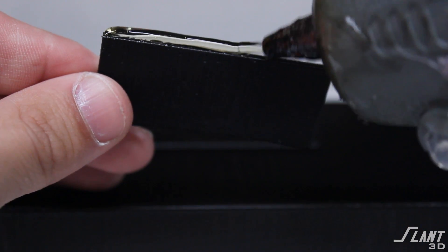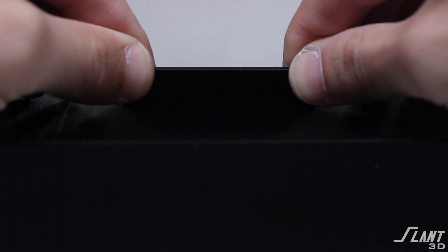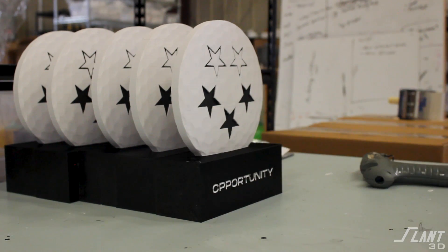There are a lot of parts out there that have to be glued together, and when gluing any type of part you have to deal with the glue itself. How much space does it take up? What are the tolerances when you squash it together? How far is it going to spread apart the parts? How well is it going to adhere to the surface? Do you have to prep that surface, drill a hole for the glue, or combine it with screws? There are a lot of factors that require a lot of extra design and effort in production.